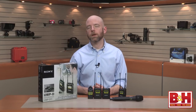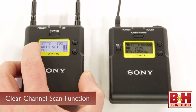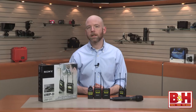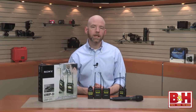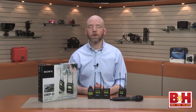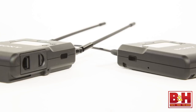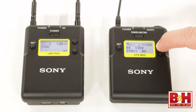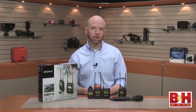Setting the UHF channel frequency using Sony's clear channel scan function is really easy. Power the receiver up, use the plus and minus buttons to cursor to the auto set page, and press the set button for at least one second. Then confirm with a second quick press, and the receiver will scan the available channels and choose a frequency with no RF interference — say from another wireless device or perhaps a TV station. The frequency information is then sent to the transmitter via the infrared sensors on the sides, so you'll want to line those up and get the units within eight inches of each other. You can also set the channels manually as well.